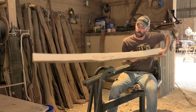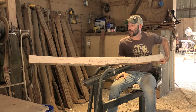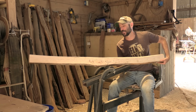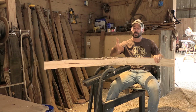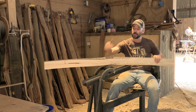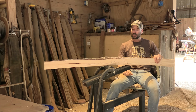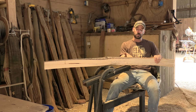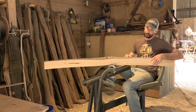All right, so everything from there down needs to go away, and then it's gonna kind of start looking like a bow. One quick way to do this is to take a chop saw and come in just outside your fades, go down a little bit, or you can do it with a handsaw, make a couple of slots, and then you can take a pry bar or something to stick in there and just kind of wedge a big hunk of this wood off the belly.